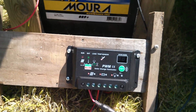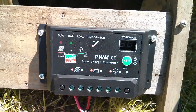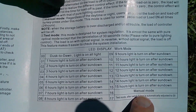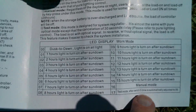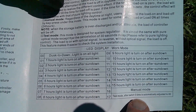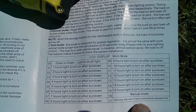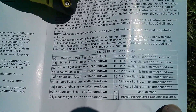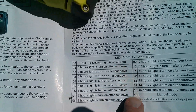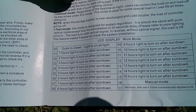It's taking a bit of time to work out what's going on here, but I think I've got it now. The battery might be alright after all. You have to put it in one of these modes by pressing and holding the button. Mode 16 is the manual mode — you can only switch it on and off manually in mode 16. Mode 17 is a test mode where you can check the operation when the sun goes down; I can simply do that by pulling the solar panel connection out. It says it's only supposed to stay on for 30 seconds, though that doesn't appear to happen. It also says that after you do the test mode five times, it reverts to mode 0. Mode 0 is dusk to dawn — the light is on all night. All the other numbers are for the number of hours you want the light to stay on.